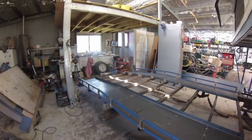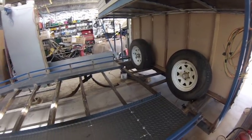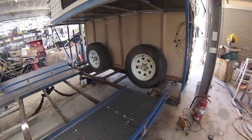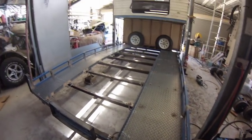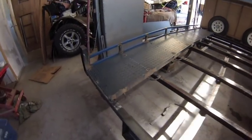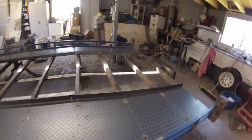All the car trailer floor steel is cut and tacked in position. The floor can't go further forward because the front wheels can't go past that point due to the overhang and front bumper. The front wheels will sit about where those three plug welds are going to be. The spare wheels are just stowed there for now — all that space is needed for the car. The amount of structural rigidity that the floor has added to the frame is unbelievable. I could bounce on one corner before and twist it a bit, but now it's just as solid as a steel trailer. The hook attachment points are coming up well — I've got six of them there and I need to put some more up the front.